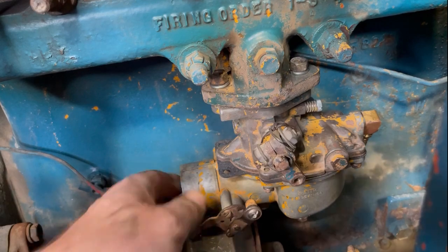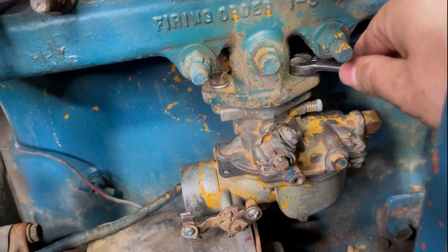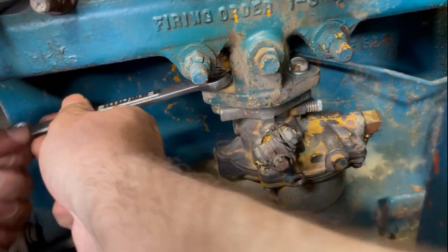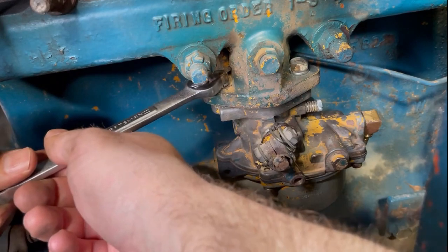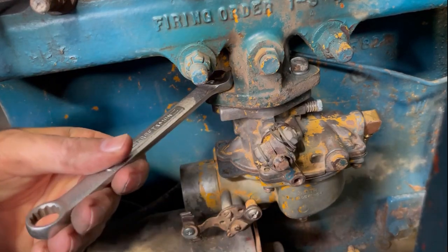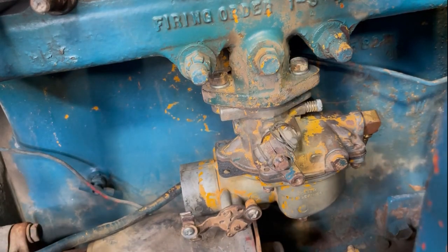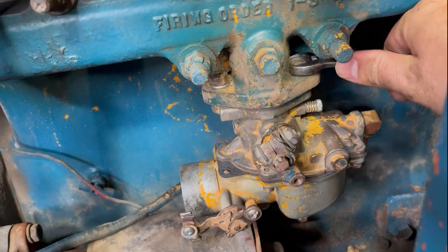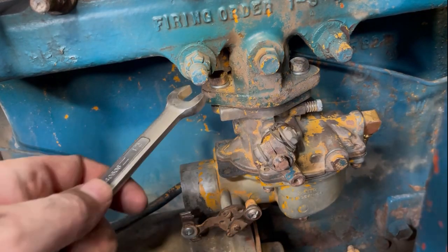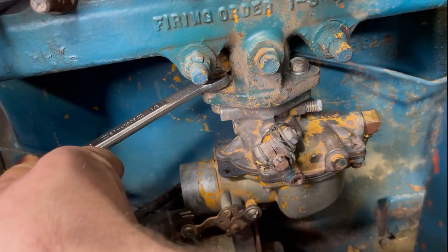So yeah, finish tightening these bolts up here. Strange thing is, this stud is basically, I think, a 5/16, but the top is fine thread. Like what I'm doing now, these are fine thread nuts, and this part of the stud is fine thread. But what threads into the carburetor seems like it's 5/16 coarse thread, so it makes it a little more complicated. If we were to break a stud, I'm guessing you can buy them, or you'd have to make your own. I think you can easily find fine thread or coarse thread studs, but mixed combo studs, not too sure how available that is.